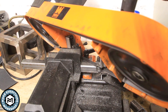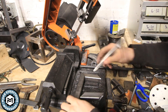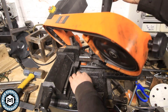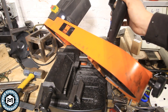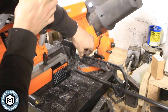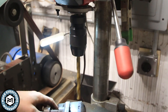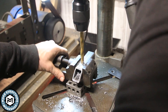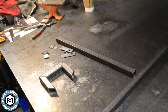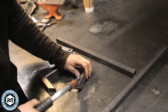I'm going to be making this out of 16th wall 1x1 and 8th wall 1x1. The clamp that I'm making right now is based on the length of the 3/8ths screws that I have in stock — I think they were like 4 inch screws. Basically, I'm just making a letter C with miters on either side of it so that I can make it a little more low profile when it's on the table. I'm going to be capping all my tubing with some 1/8 inch, 1 inch plate steel and drilling holes using one size above a 3/8ths inch drill bit, which is about a 13/32nds, so that I get a little bit of a clearance fit but nice and tight nonetheless. This little clamp is important that it's nice and square and strong, which is why I went with the 8th inch material for this versus the 16th.